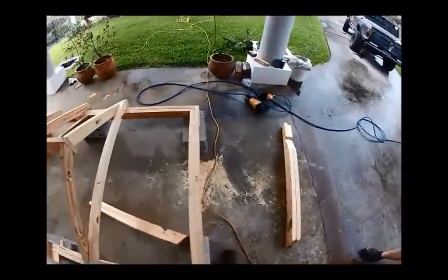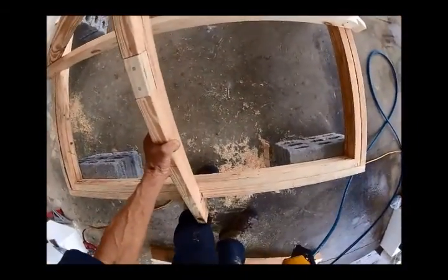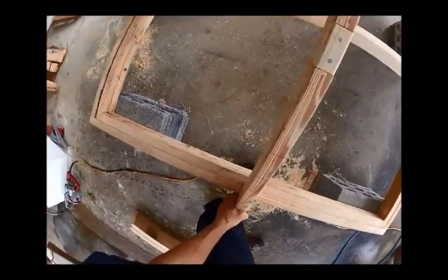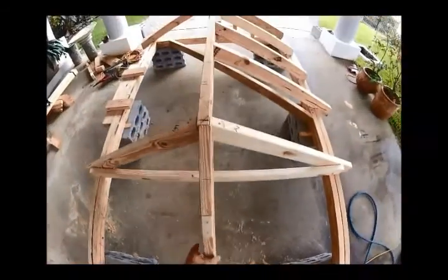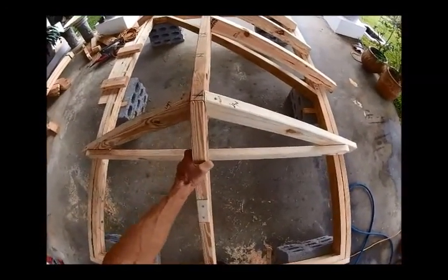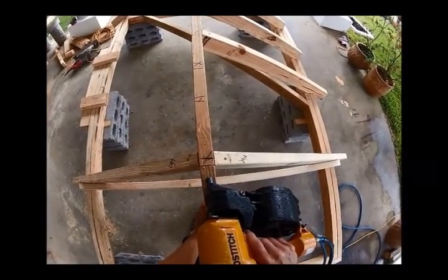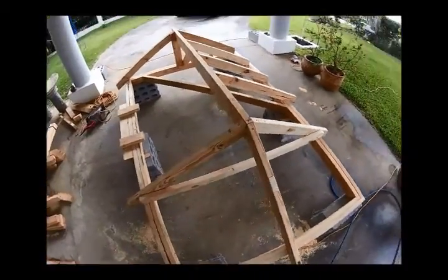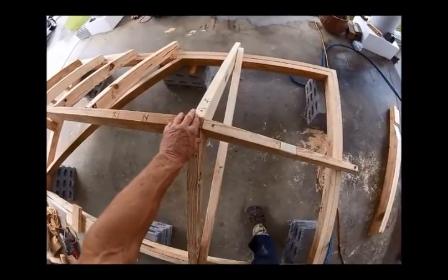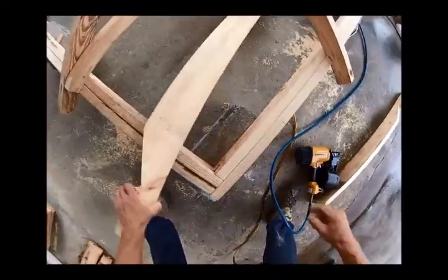Now to run these guys, you need your king common and just put in the center common — should be right if we plumbed up everything correctly. As you guys notice I'm not nailing everything off; we have to tear this mock-up down, so I'm just doing things real lightly. The proper alignment for common rafters is that it planes in with the edge of the hip.